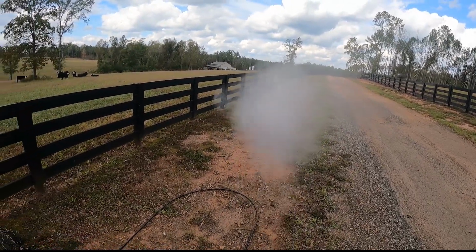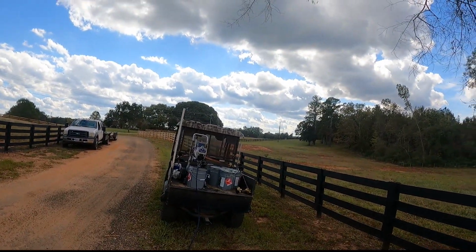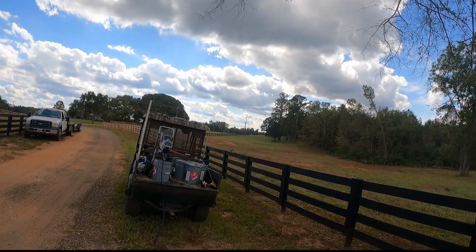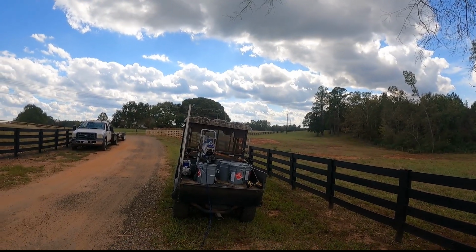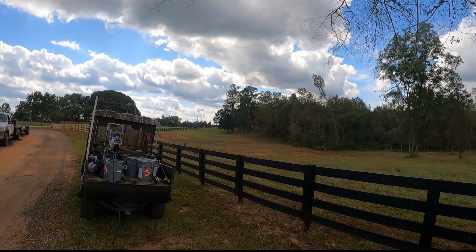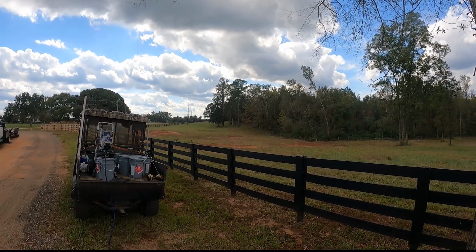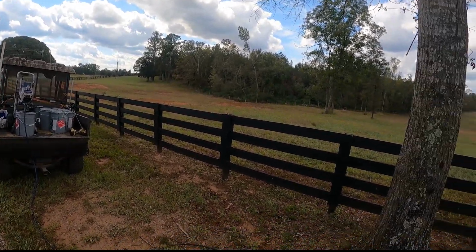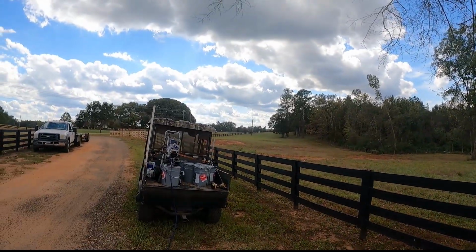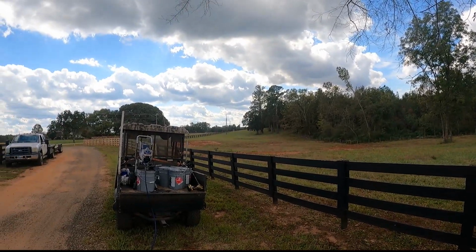And the mineral spirits, so another caveat to that is I clean that sprayer out with mineral spirits, but that's only if it's going to sit for maybe a week, 2 weeks at most. If it's going to sit, like once I'm done with this fence painting season, which I got this job and 2 more jobs this year. Once I get done with painting for the year, because once it gets into wintertime, gets real cold, I don't paint anymore because paint won't act right.